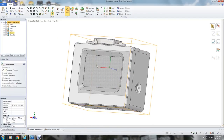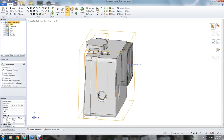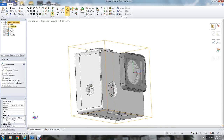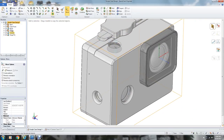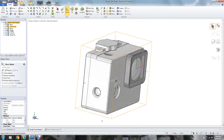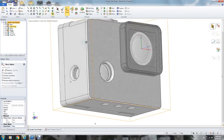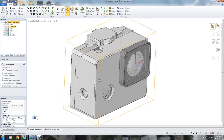I want to just glue a thin piece of plastic here — I haven't decided exactly on that yet. And mold some kind of silicone rubber in here where these buttons are, in such a way that I can still depress the buttons. It won't leak coolant through there because there's no real external pressure in the application I'm doing. So this is what I've designed and what I'm going to try to machine here.